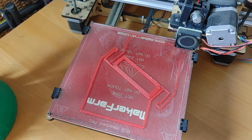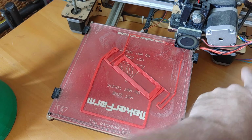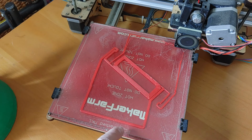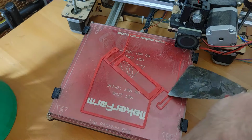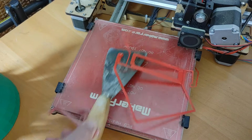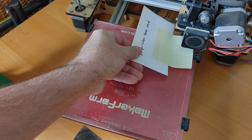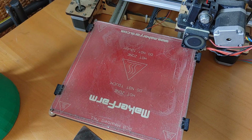It can matter if you have the printer at an angle or something, but anyway, what we do from here would be to auto home it again by adjusting this little nut again with the micro switch. And we might have to lower these other sections of the print bed. That actually feels good, so maybe we'll just give it another shot and see if there was maybe just a minor hiccup in the initial printing process. Oh, there also wasn't any hairspray on that side, so I'll raise up the hot end and make sure I get some hairspray under that section.